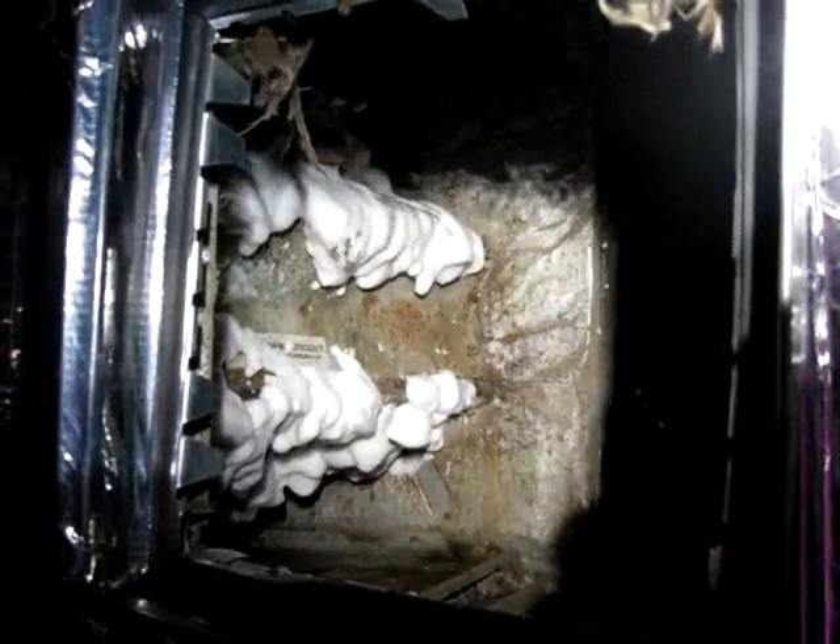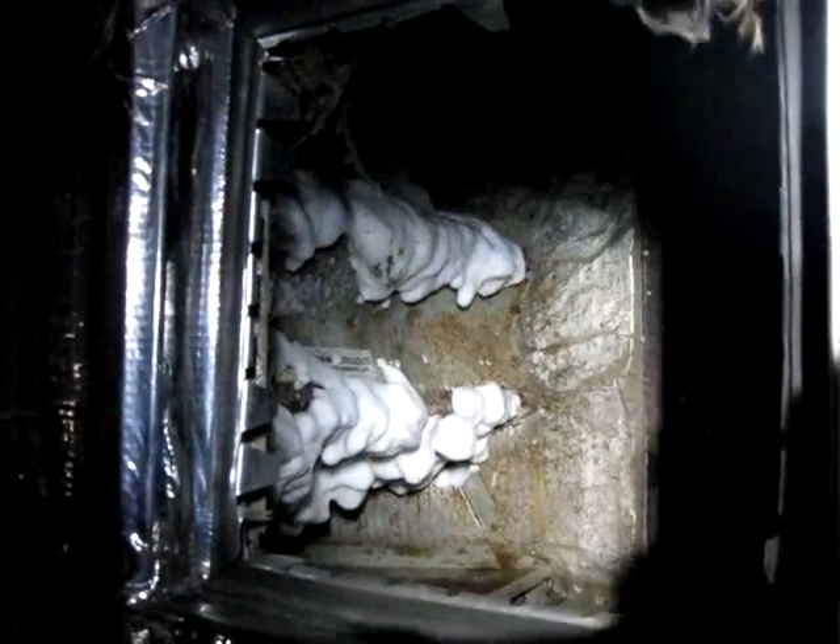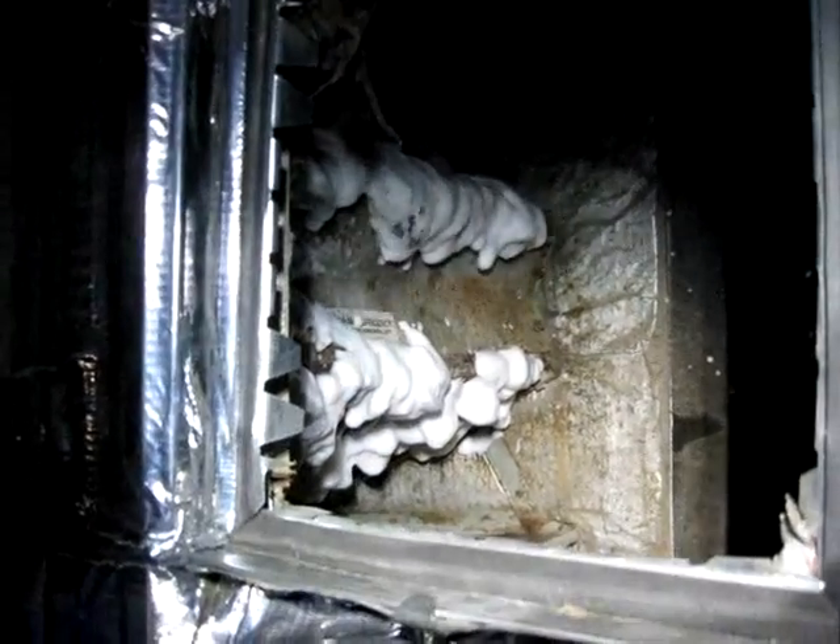Here's our evaporator coil — you can see up top it's still dirty as hell. There's not much you can do about it. I spray the foam on it to clean it off, but if I were to brush it, it would fall off. If I move my finger across where that suction line runs, pieces of it would actually fall off — I can't brush it because it would just fall into pieces. The bottom is a little bit better. She's all foamed up — I'm going to foam her from both sides and see if we can get some of that off without destroying the coil.